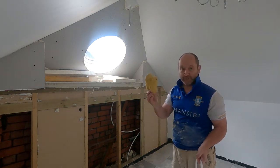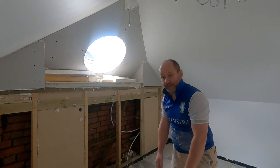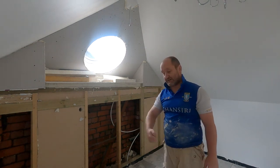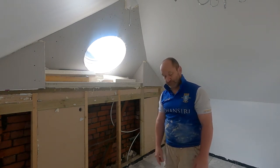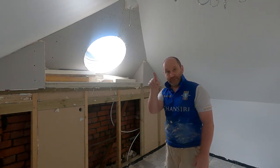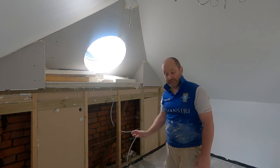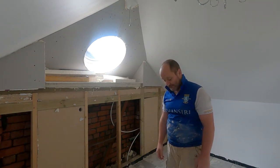So, grout in, sponge, lots of buckets of clear water. Get your grout, mix it up, not too much because it goes off quite quickly. And using a float, whack it into the cracks and then buff it off with the clean water and the sponge, and that leaves a nice surface. Don't push too much because you don't want to create a dip like river channels. You want it to be level, so it's a gentle buff and get it cleaned up. And then after a few hours you just start cleaning because you'll have lots of residue and dust. So it's going to take me a couple of hours, I think,